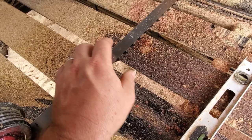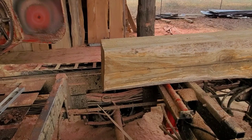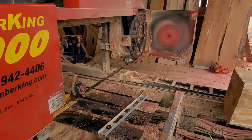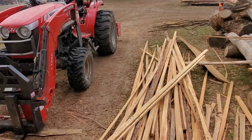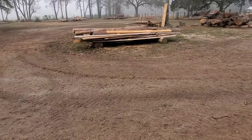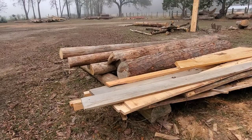The biggest thing was the blade sharpness. I just threw on a brand new blade — it's a Timber King Ultramax — so I expect this to cut very crisp and very smooth through this log. Another thing to look at is your speed of cut. If you're cutting through a log extremely fast, you could potentially get a dip or a dive. I'll show you an example — this is a log I was cutting last weekend, one of my own logs, and I was just trying to cut through it as fast as I could.